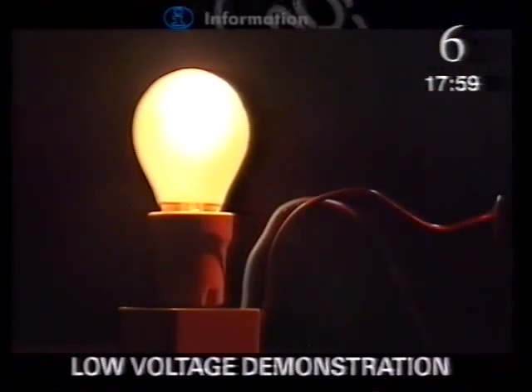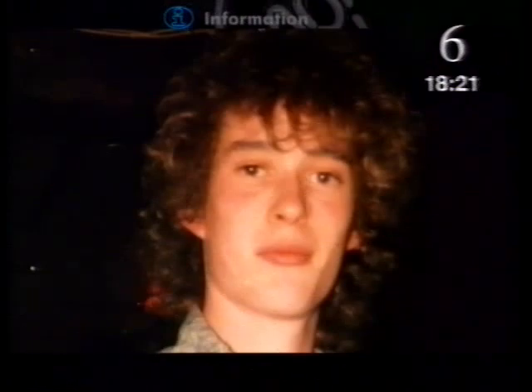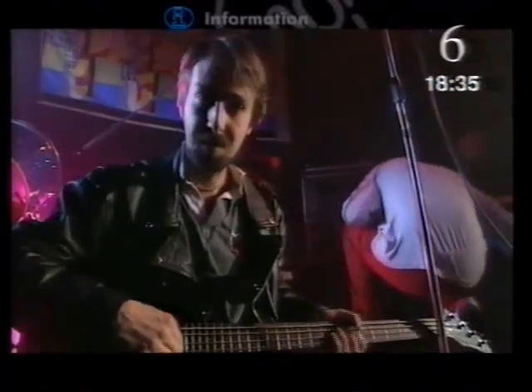What does protect you is a residual current device, or RCD. Receiving an electric shock will still hurt, but the risk of electrocution is much less. All circuits have two connecting wires, and the current flowing in each wire should always be the same. If you accidentally touch a bare wire, the leakage is immediately detected by the RCD, causing it to trip. If Philip Handy had been protected by an RCD, he would still be alive today. Everybody involved with that band now uses little circuit breakers that you can plug in to your amplifier — even if the building you're playing in doesn't have one, you can get one for yourself.